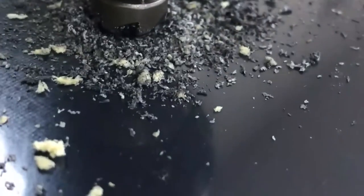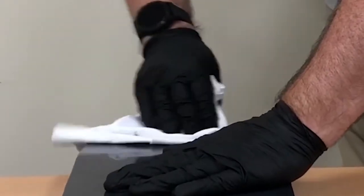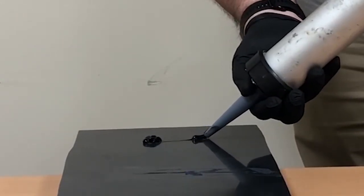Here's a good trick — this is one that we use in the trade and that boat builders use. Chris is using a little tiny countersink; he's not pushing too hard. It's on a composite panel and he's just put a little tiny countersink at the top of the hole. That's a good trick because quite often we're in a hurry and we want to bolt the fitting down pretty quick. If we bolt it down too tight, we can squeeze out a lot of the sealant. But with the countersink, when we bolt it down, it forces some of the sealant into that recess, getting a really good seal around the bolt. You don't have to use a countersink — you can use just an oversized drill, just a quick swizzle around with it. It only needs a very small amount, but it's well worth doing.